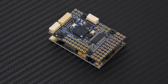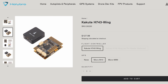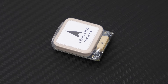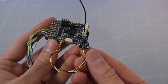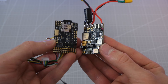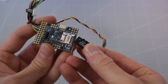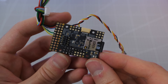Now to install ArduPilot on this rover, first we need a flight controller. For this build I'm going to use the Kakute H7 Wing, sent to me by Holybro. In this build I will also test their M10 MicroGPS unit and for the first time a proper Mavlink telemetry setup with their Holybro Telemetry Radios V3. I soldered the LRS receiver and the telemetry wires to available UART ports and also soldered the power connectors to the bottom side of the board. This board has a massive amount of interfaces for future upgrades, and because of its H7 processor and SD card slot, it can run advanced ArduPilot LUA scripts for things like automatic PID tuning, obstacle avoidance, and much more.